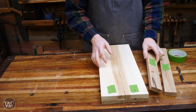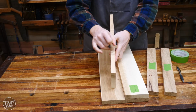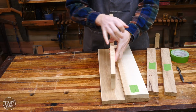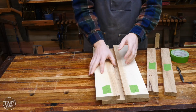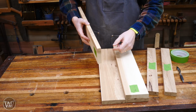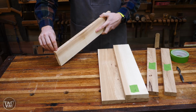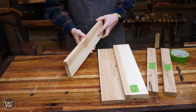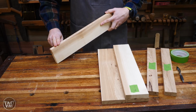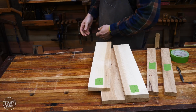Now in the plans I have 1 inch thick material, and you're going to come in a 1/2 inch and notch out that. Now the actual depth of that notch really doesn't matter that much, and so in this case I'm actually going to be coming in a smaller amount because I don't need that notch to be full depth, and I'd rather actually leave a little bit more material on the stock so that it becomes a little bit more strengthened, supportive, something like that.